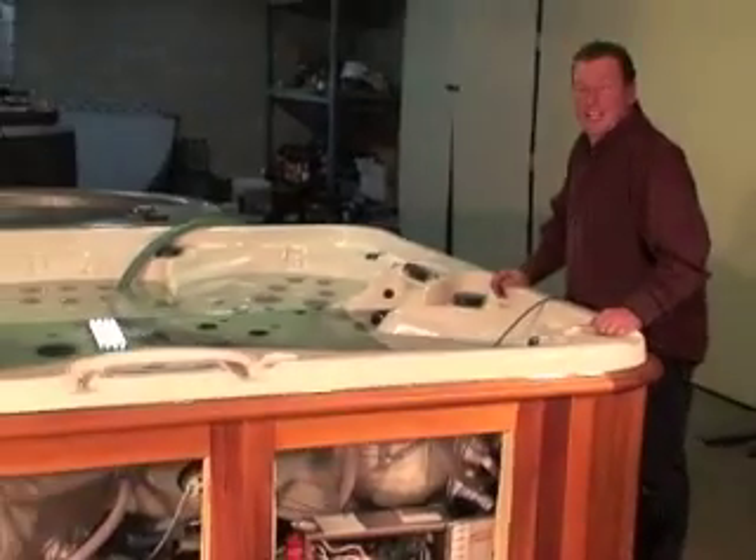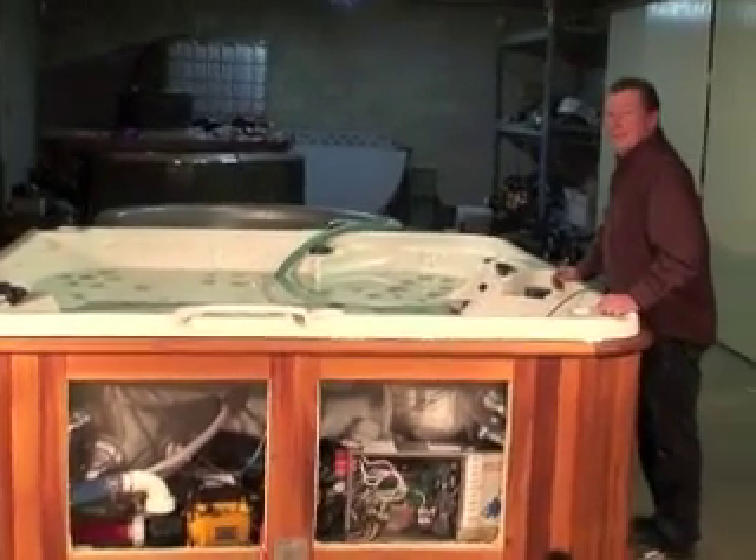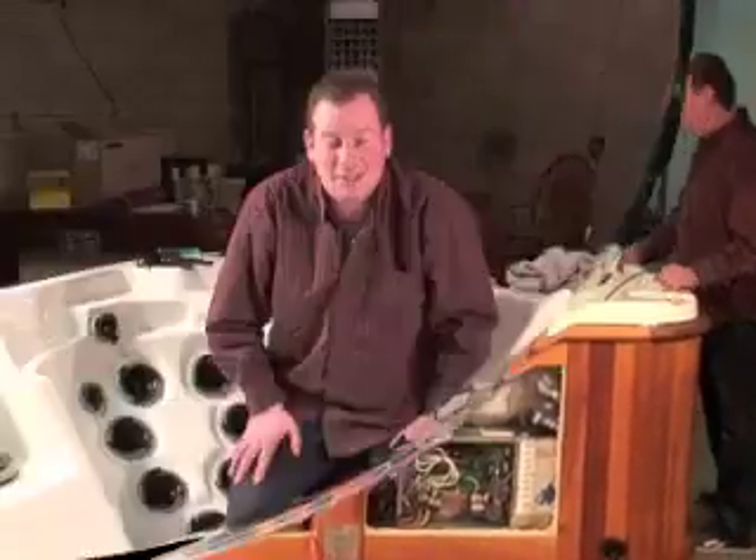So what are we going to do first? We're going to sump off, we're going to drain the spa, we're going to dry out the area of the jet that's leaking, and get it sealed up with some plastic welds. So give us a couple minutes to get prepared and we'll fix that monsoon jet.